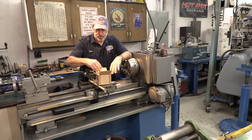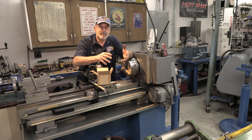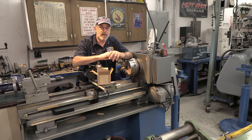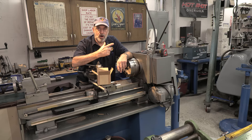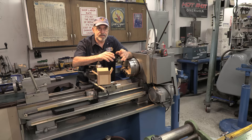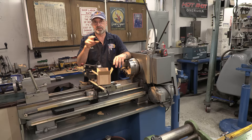While I was healing from my surgery, I was on the phone and on the computer shopping for quite a few things so that I'm able to perform the work the way I want to on rebuilding Pearl's gearbox. I invested in an arbor for the K and T, new wheel cutters for cutting the spline, and soft jaws so that we can grind the inside. That's what this video is going to be about — setting up the soft jaws and getting that ready to grind.